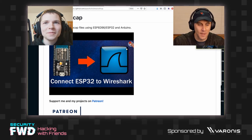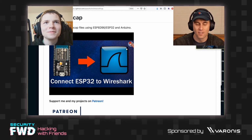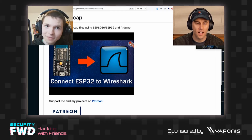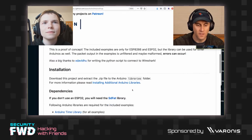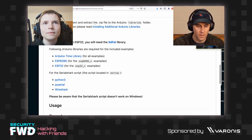So as you can see, what this is designed to do is interface with more powerful programs that are designed to do packet analysis, so that even though we're not going to be passing maybe capture filters or something over to the ESP32, which by the way would be an awesome feature, we can still have all those packets go to a program that is able to read them. And there's a little Python companion program that's included in this that is really helpful and cool.